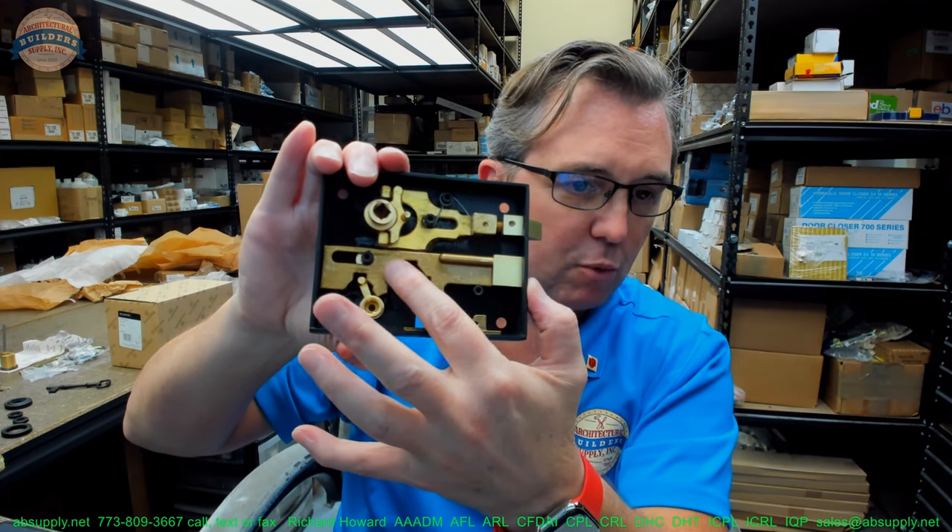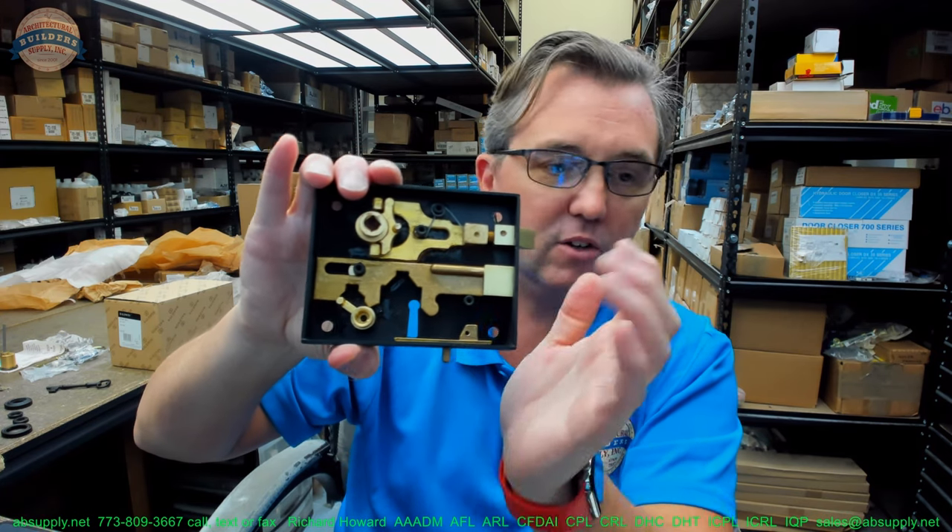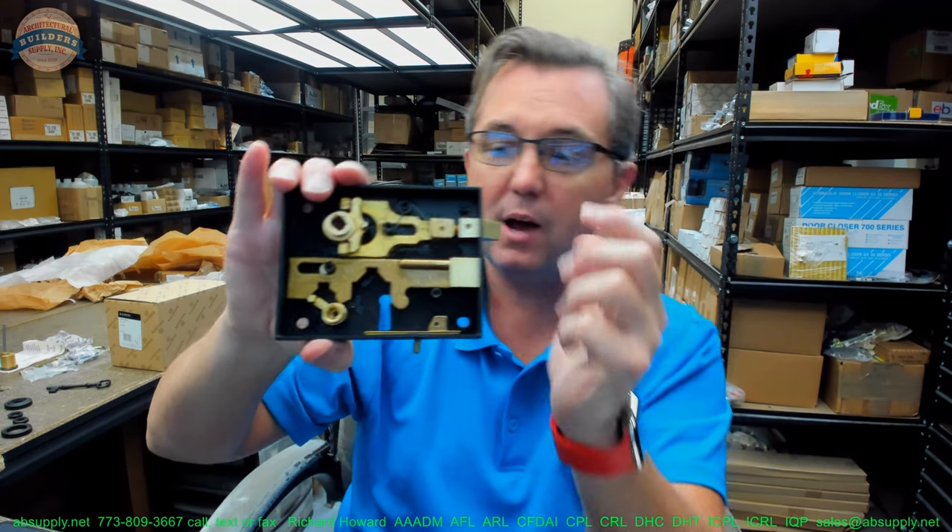The business end is obviously the bolt. That little lobe — that feature right there — is what prevents the bolt from being thrown and retracted. This is the lever tumbler: the item that the key interacts with to move the blockage. This little gizmo sits right in that crotch so that you can't push the bolt back until you insert the key and move that lever, getting it up to where you can then operate the lock. Because it's spring biased, it will then fit back down.